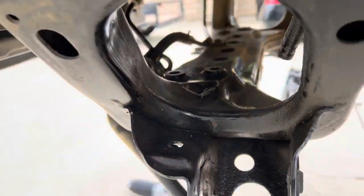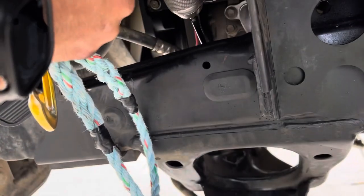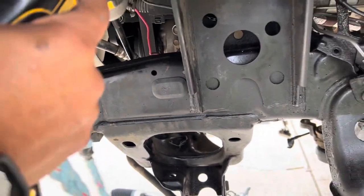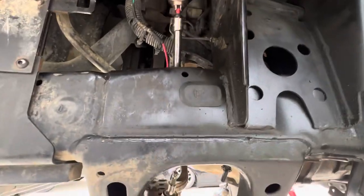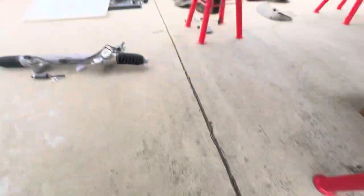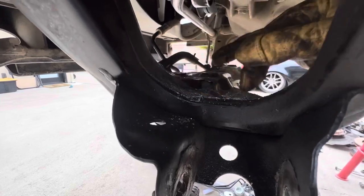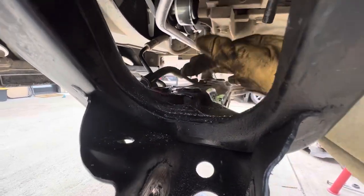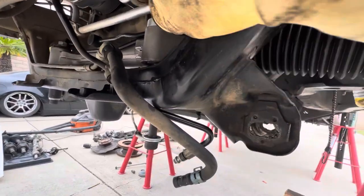It's gonna be welded on both sides now and then I'll have the bracket on top — I think it's gonna be perfectly fine. What I'm gonna do is come in from the top, hit it, drill it, and take it down that way. I ended up using a little punch because that other way didn't work. I punched it straight through — it's a pretty good size hole. It called for an inch and a quarter but I went for an inch and a half, so I'll have about a quarter inch on each side, which should give me what I need and I won't have to fight it if it doesn't fit.